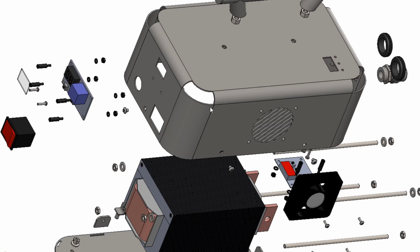Then these bits of stainless were cut out to fit in here. The box was then purged, TIG welded, so there was argon, and all the oxygen was pushed out of the box. The lid was put on it, or the base was put on it, and all these holes were taped up, and the box was purged. The reason it was purged is because if it wasn't purged and I kept sanding the weld back, I would have ended up hitting holes.